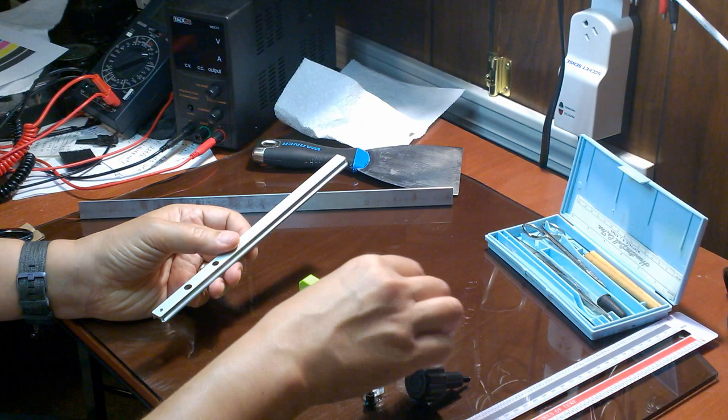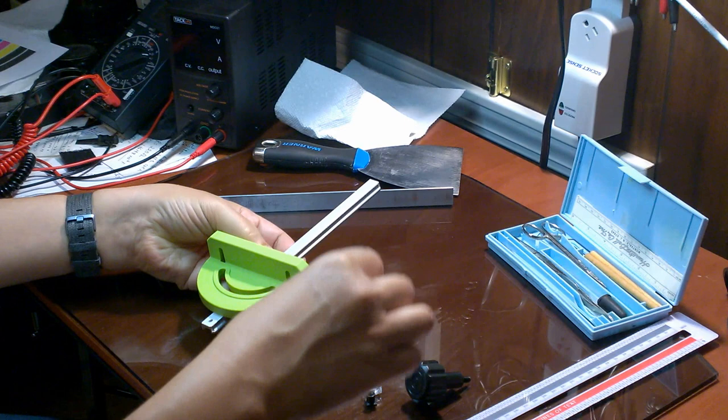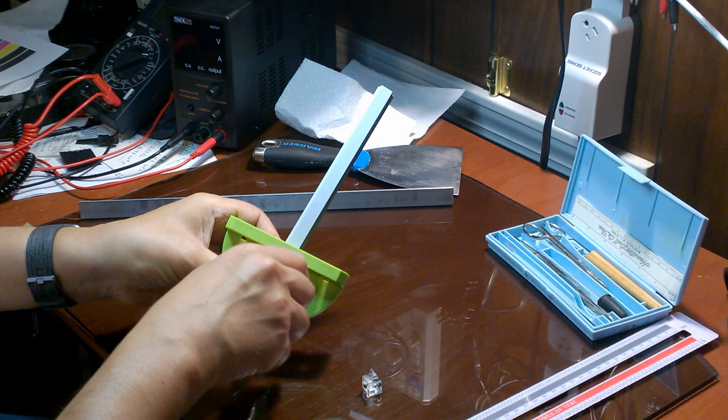Gather the 4 pieces in addition to the rail. First, place the graduated fence on the rail. Align the plastic pivot in the topmost hole. And holding the fence against the rail, pass the threaded insert up into the second hole from below the rail. Then screw the knob onto the threaded insert and snug it up, and there's no real need to tighten it at this point.